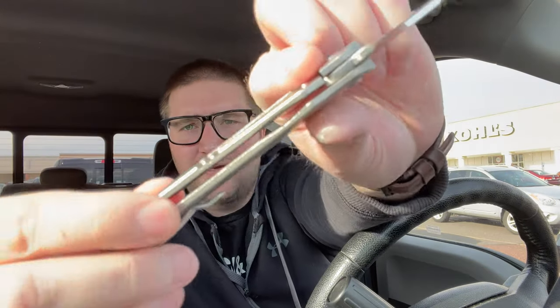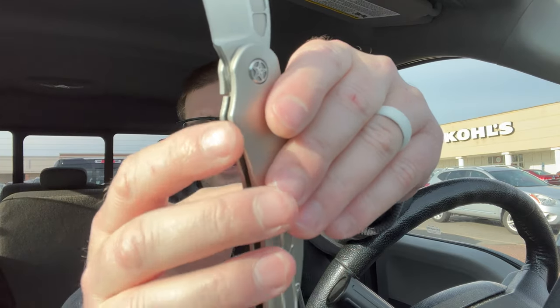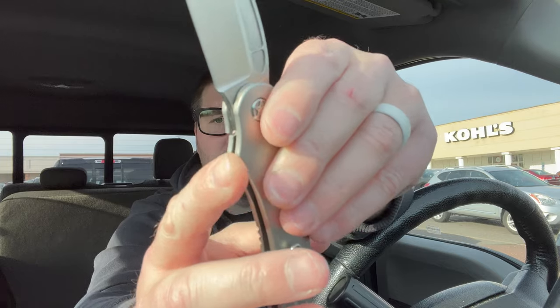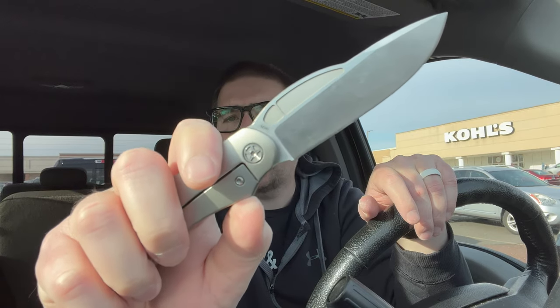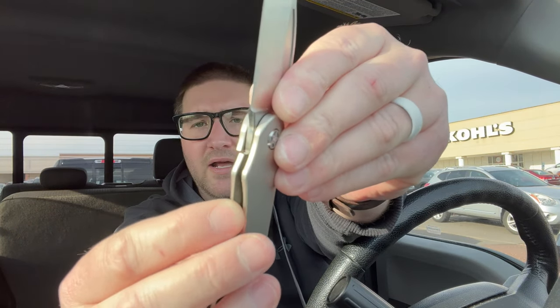Right-handed it works too. Disengaging the lock bar — there isn't much of a cutout, but you want to disengage it in the right spot. Don't try to push the hump at the top; instead disengage right under that hump and you get plenty of room to get in there, drop to your nail, and shake it home. I've had no issues with the lock bar, and left-handed it's even easier.